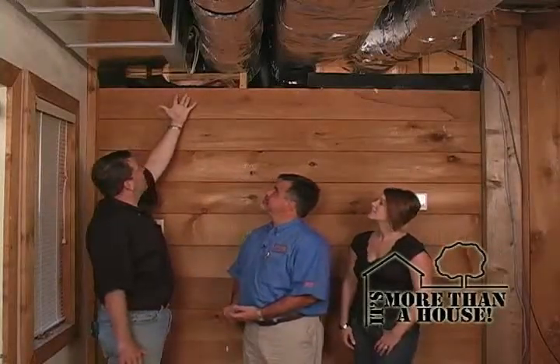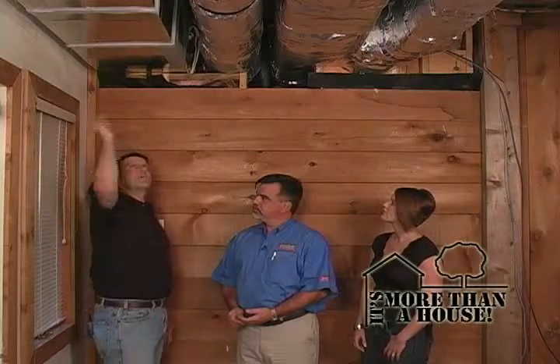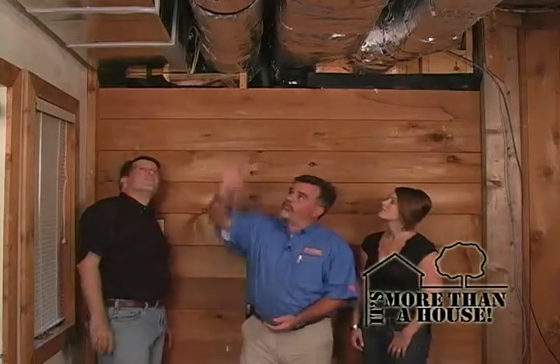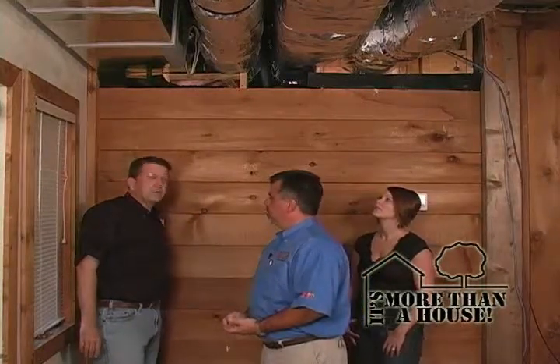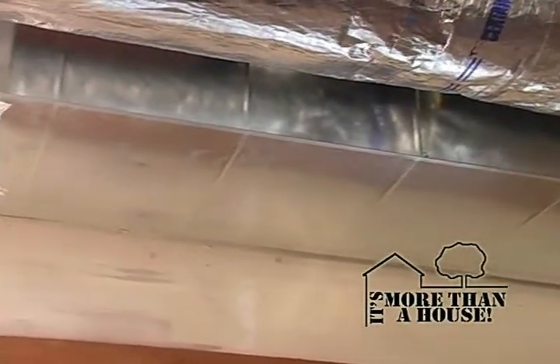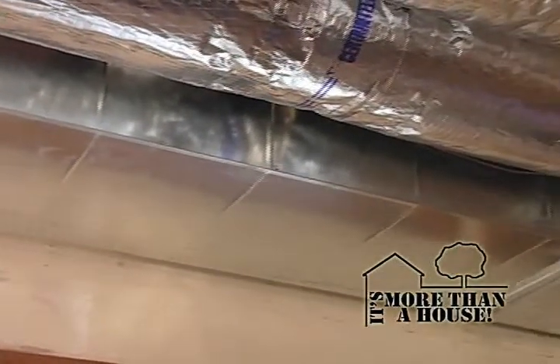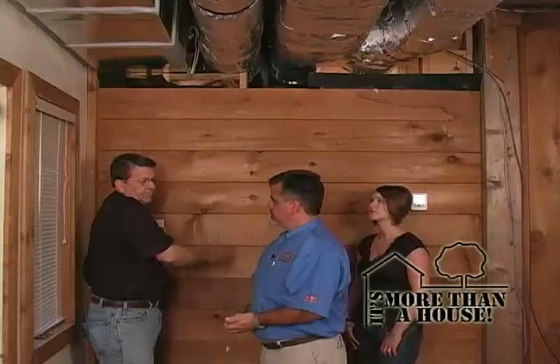We're on the other side of the furnace room now, and these are the ducts we saw — a little more condensed over there. What we have on the end here, which is the bare sheet metal, is the return air plenum. We've run a square duct down the length of the house, and all the returns tie back into that plenum. This is the air that has been to the room, coming back — it'll go through the air cleaner, get conditioned again, and be reintroduced back into the house. It's just a continual process.